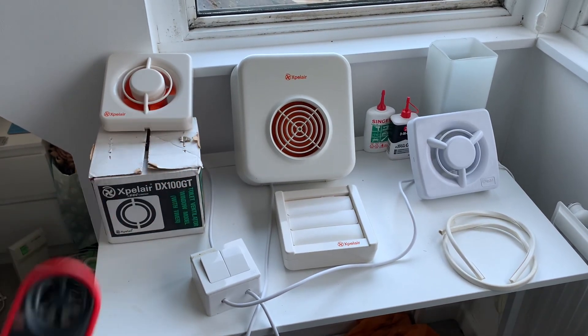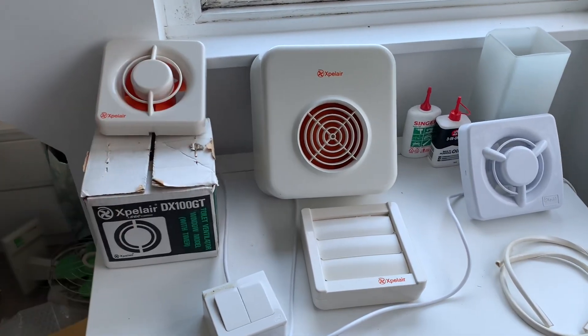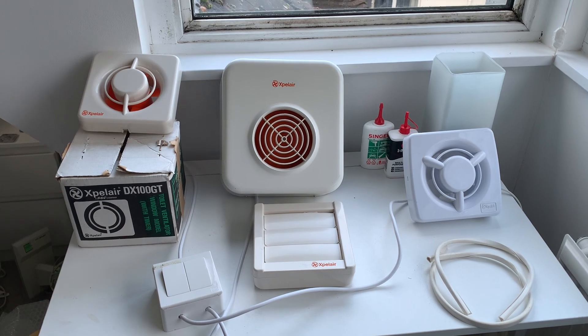Something to bear in mind — you actually see quite a lot in modern-day bathrooms where axial fans are just shoved into the ceiling, and they don't produce nearly enough power to actually get the air out of the building. I'm going to use this anemometer here to measure the output of the fans and see just how different these two models are. So, without further ado, let's power them on.